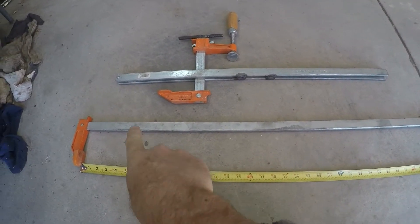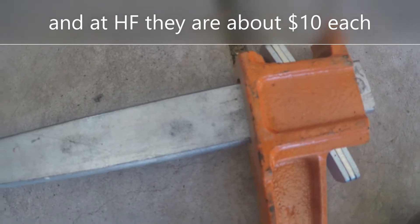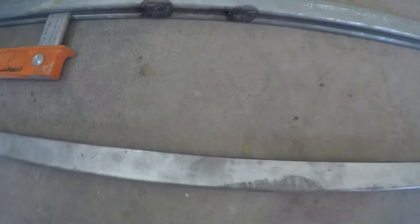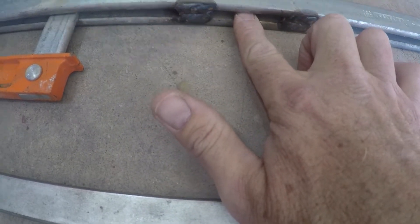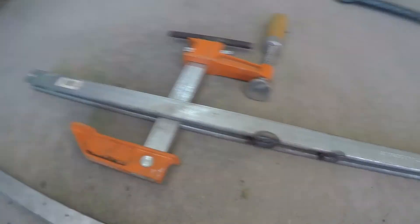This is made from a 36-inch bar clamp — about $30 for a pair on Amazon right now. That catching mechanism is real easy to make tight and easy to loosen. As far as measurements: the bars are cut right at 30 inches — both of them. I used a couple of 1-inch spacer pieces inside, about 2 inches total, welded on top and bottom, just to space these apart so the bar slides through easily on each side. We'll go ahead and modify this one to make it longer to get a little more lift out of the tire.